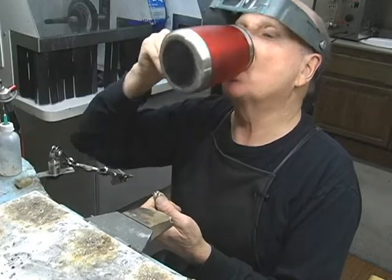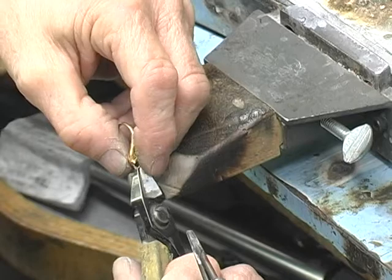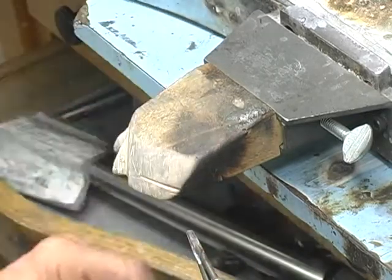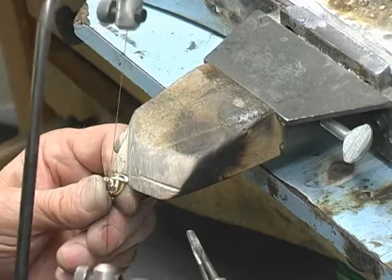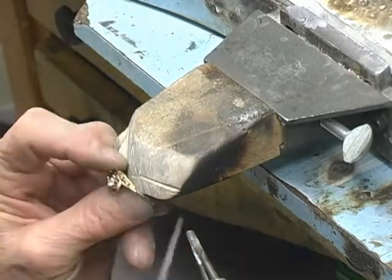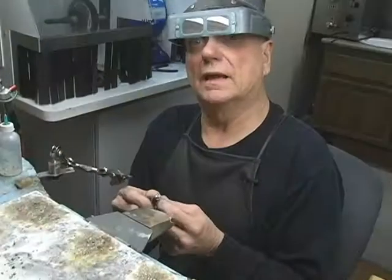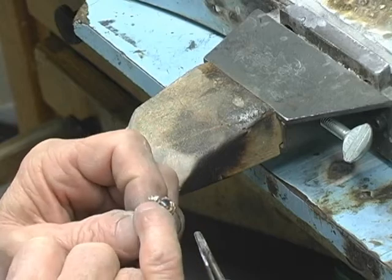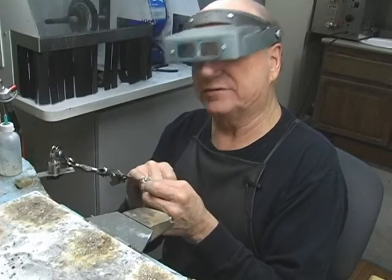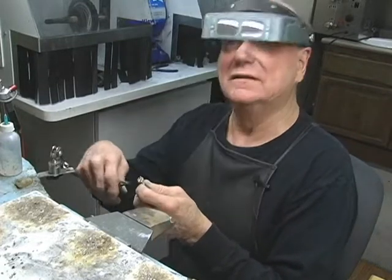A little more coffee. Back to hyperspeed — are you ready? One, two, three, here we go. Sometimes you take a jeweler's saw and trim up your prong. A lot of times when you're doing these kind of jobs you have to go back through and add a little solder. I have a little bit of a holiday — a gap right here — and I've got a pit mark in one of my tips. So I'm going to reheat those, throw a little solder in here and reheat the tip and we'll be good to go. Whoopsie — lap pan. Glad we have a lap pan. Kept me off the floor.